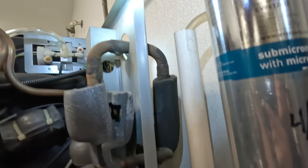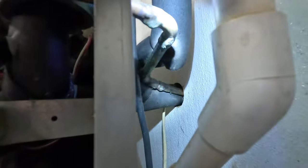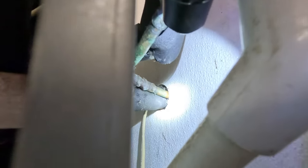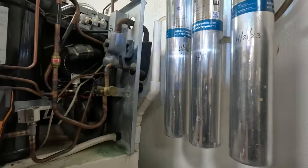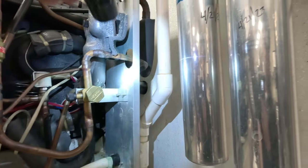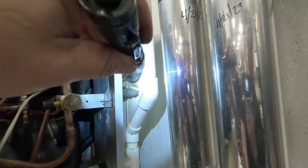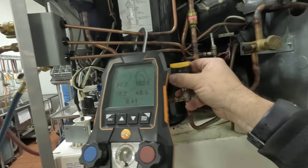On the back side here it comes out with some 90s, goes to another 90, and makes another 90 — somebody just got way too happy with the 90s. And that refrigerant solder joint there looks like crap. I have a bad feeling they may have ended up doing fittings in the wall, which is absolutely asinine. That should have been done with an air conditioning line set soft copper all the way up.